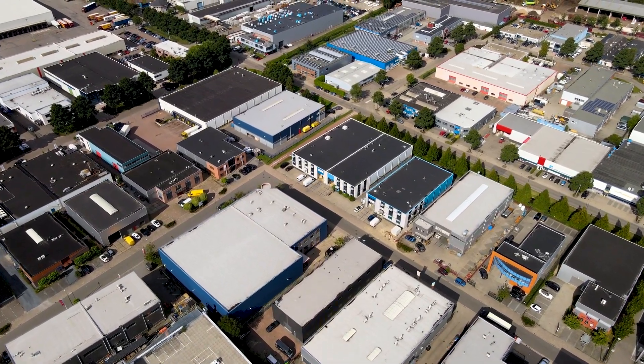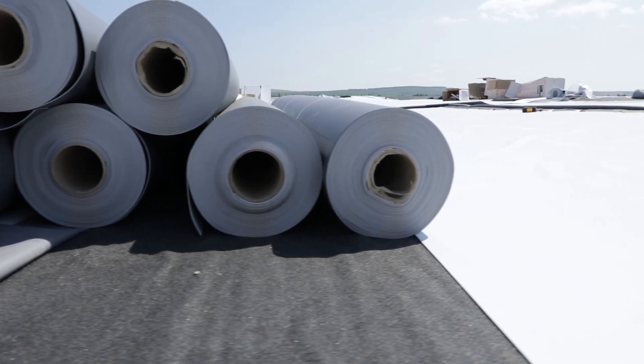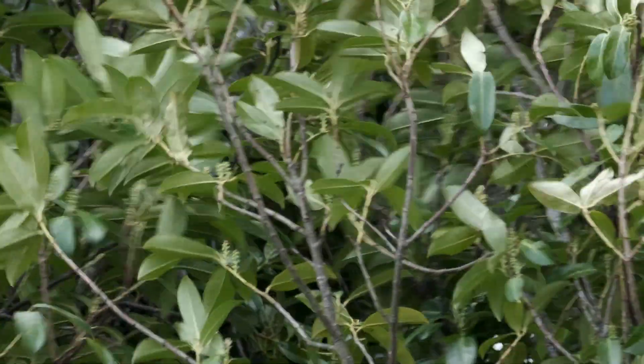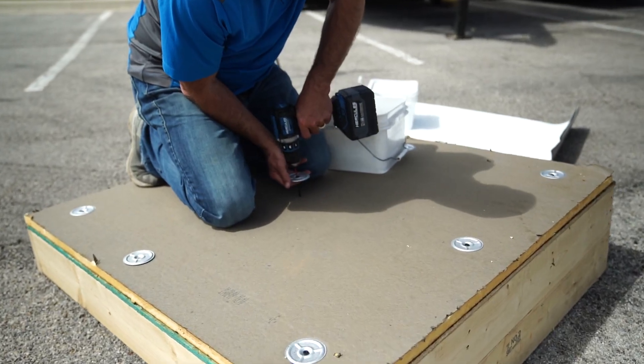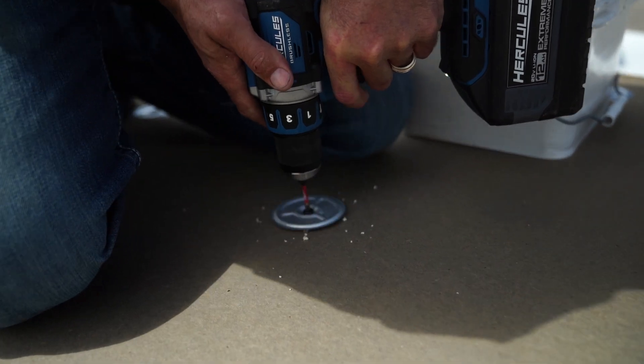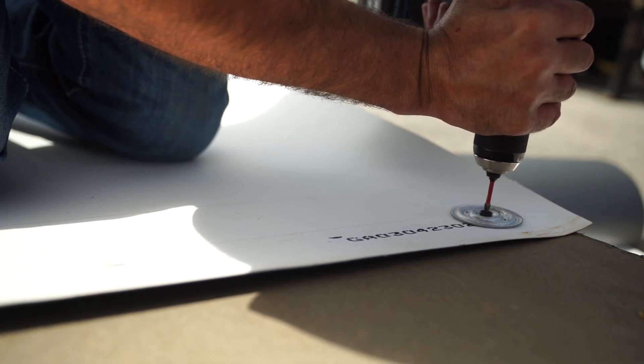One of the main areas where you'll find mechanically attached systems are places where wind uplift is not an issue and city code requirements do not require high wind uplift resistance. The reason being is we have 10 feet between each seam, and that TPO billows up when wind pressure increases — the only points of contact are those two lines of screws and fasteners. In a hurricane zone or high wind zone, you have to dramatically increase the amount of fasteners and reduce the distance between them. To summarize the steps: attach the ISO or insulation board mechanically with screws and plates, then attach the TPO on top mechanically with screws and plates — hence the name mechanically attached.